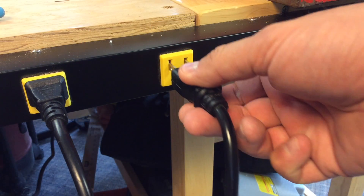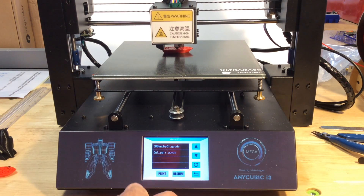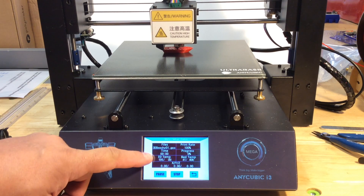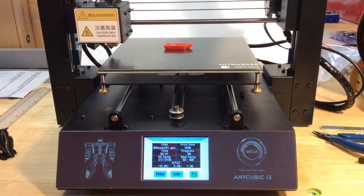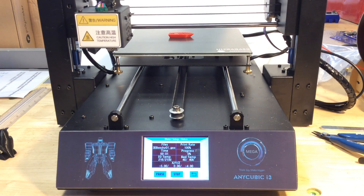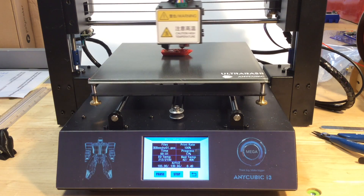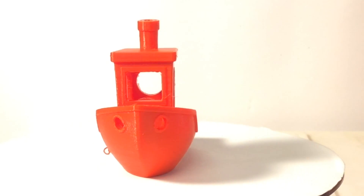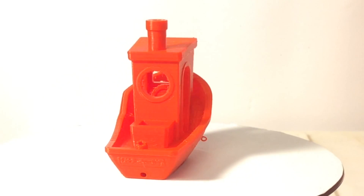The nozzle was stuck on top of the part. I plugged it back in — the switch was still on so power came back up, it went through its startup routine and then went right to its standard menu. I had to press print, select the Benchy again, and then click resume. I actually had to hit it twice because of the resistive screen. Then I had to wait for it to heat back up, which took a few minutes. Once it did, it homed itself — this is why they don't recommend anything towards the front if you're using this feature — then it leveled itself, moved back up to the proper height, and went over to the print. There was a little piece of plastic hanging from the nozzle I was supposed to pull off, but it went to work printing. When it was done, you wouldn't know it stopped and restarted other than a small blob on the side. I couldn't see any line where it stopped and started.